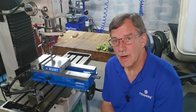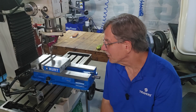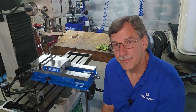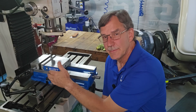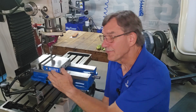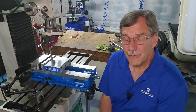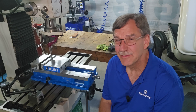As you can see, we got that in one shot. I've seen many other people wrestle with these things and go back and forth countless times trying to get that needle to stay on zero at both sides of the vise. The trick is: tighten one nut — left or right, it doesn't matter, I just consistently use the left — leave the other one loose, and use a second indicator so you can see if it moves at all and by how much, then adjust the spindle indicator to match the stationary one. Thank you for watching. I hope you learned something and that your day is a little bit easier just for watching it.